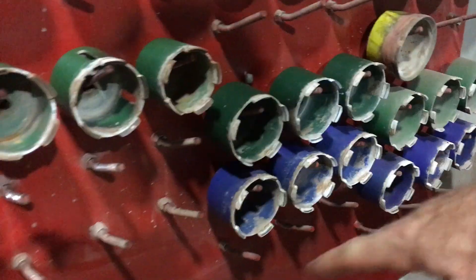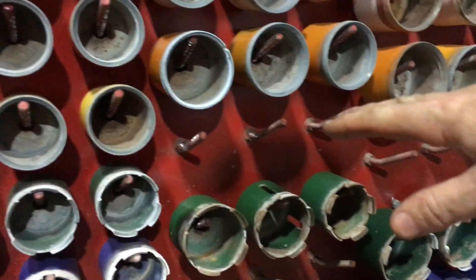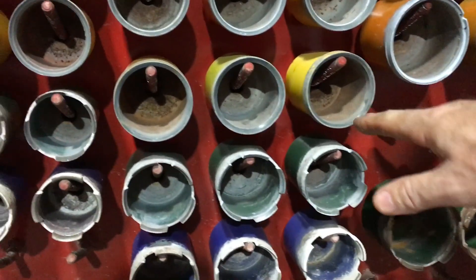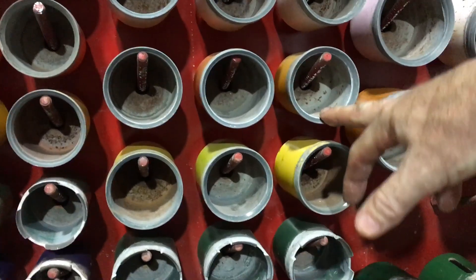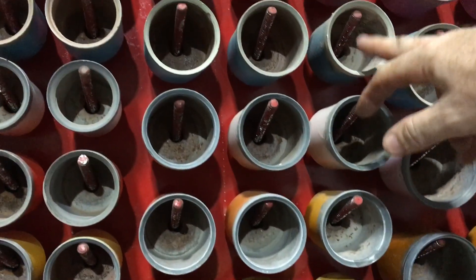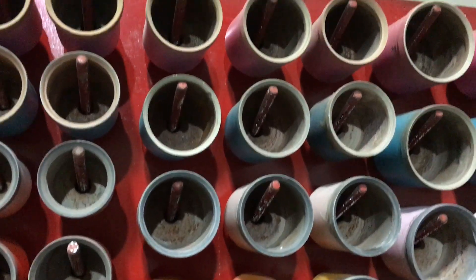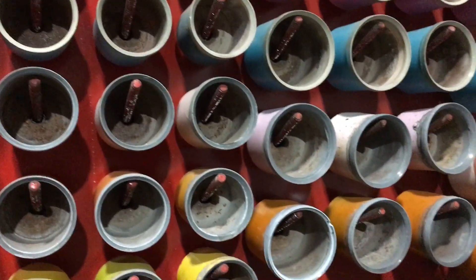So that gives you a feel for rough grinding. I covered in some of the other videos all the different grits: blue is 220, green is 400 — that's our metal bond. Then yellow is a 400 poly, which is a big step between there — you're cleaning all the metal scratches out with that. Then 800 poly, you're only running a few minutes. Then 800, 1200. And if you have more difficult stones, then we run 4,000, 8,000, and then poly for diamond or poly for cerium, depending on the stone.